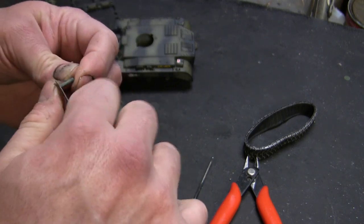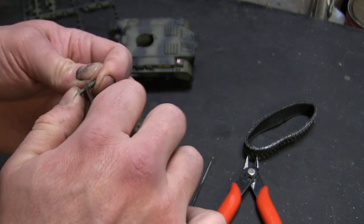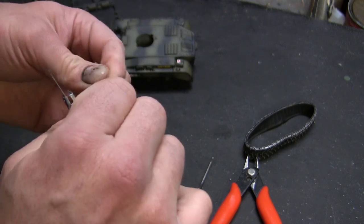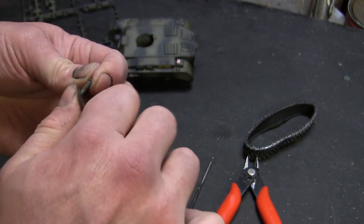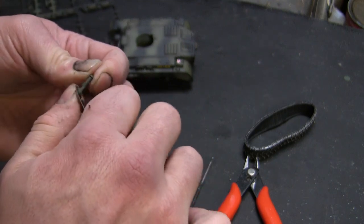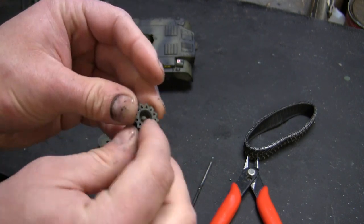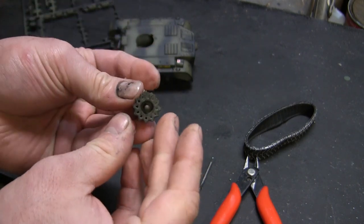By removing the layers of paint, this will open up the tolerances and will make the mounting of the parts a little bit easier. The part can slide into place without there being any interference from the thing binding up from extra gunked up layers of paint. To test it, I'm just going to slide it in, and as you can see, the piece drops directly in place where it needs to be.